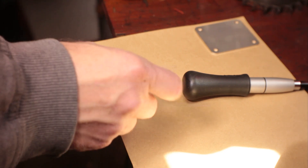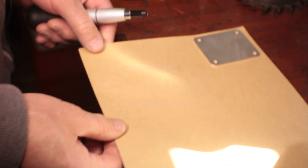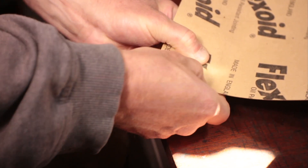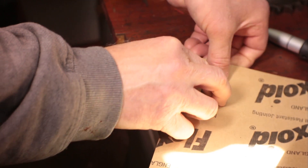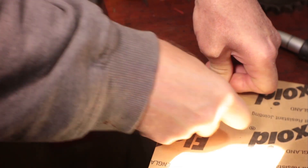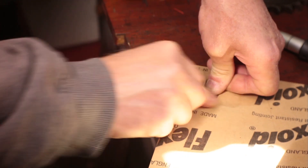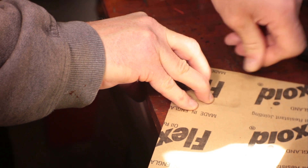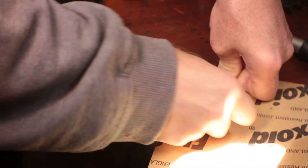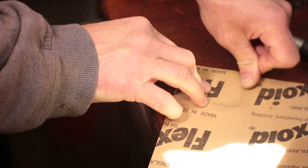I've been watching the amazing Mr Mealyards channel and he makes it look very easy to make gaskets, so I've got some gasket material now. How hard can it possibly be? Apparently you take the piece and rub your thumb all around it pressing very hard, get it down on there without moving it. I've seen other people spray oil on the piece as well to make an oily mark, but this seems like it works just as well.